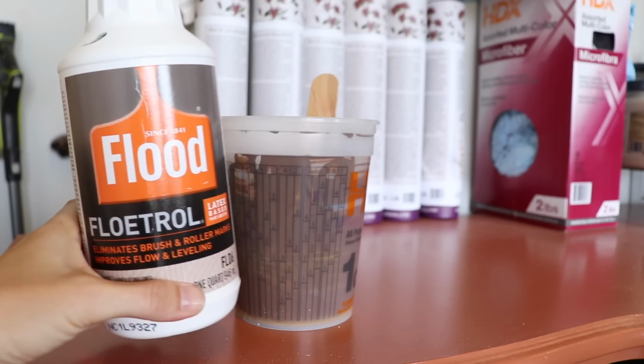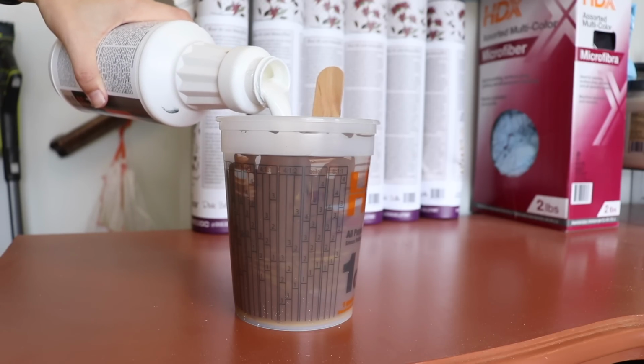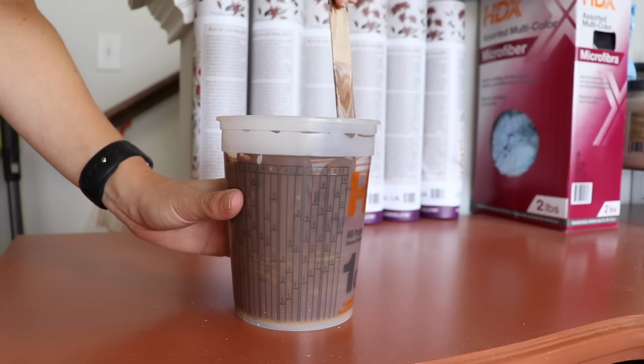That is looking really close to my Uber Umber inspiration color there. And now I'm gonna add a glazing medium to help me get this textured look that I'm going for. I add about a 1-to-1 ratio of paint to glazing medium.